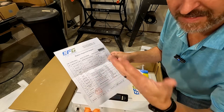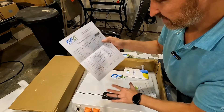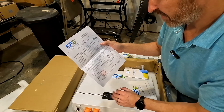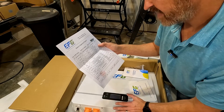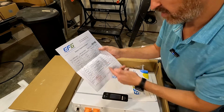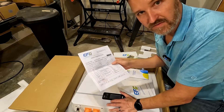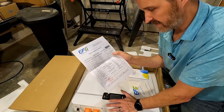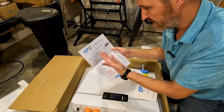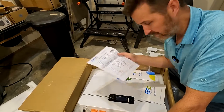So 103.8 amp-hours capacity. The report covers the width, height, and appearance — no scratches or dents. It checks LCD functionality, the ability to disconnect the battery output, and whether you can use the battery software monitor through RS-485, RS-232, and the CAN port — all checked. Items packaged with the product like terminal screws, rack, and expansion bolt all passed. This is really good to have — if you receive a battery with damage, you can email them with a photo of this sheet and get a refund.